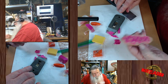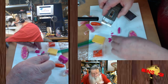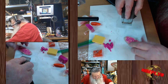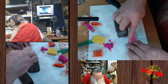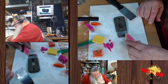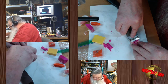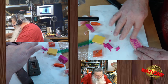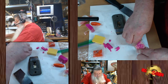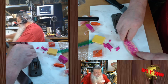Okay. So I'm satisfied with that. And all this other stuff is going to sand off. I mean, you can go through and give it a little bit of one last scrape. The biggest thing about this stuff is you don't want a mound. You don't want it humped up. You want to get it fairly flat, fairly thin. The reason being is you've got to sand all this off. So if you hump this stuff up a quarter of an inch on top of this wood, you're going to sand a quarter of an inch of this stuff off. So I would suggest you didn't do that. That kind of makes it nice that you can push down on the tile and kind of wiggle it a little bit and push it in.